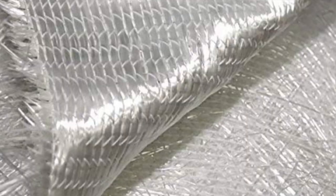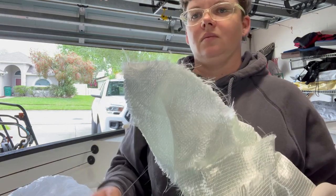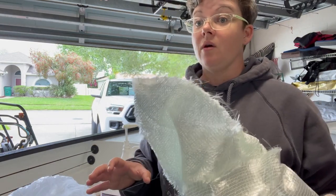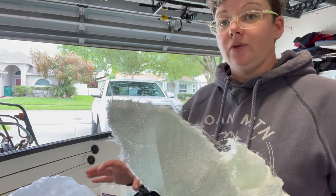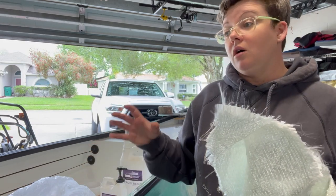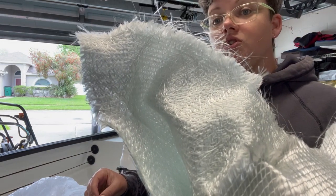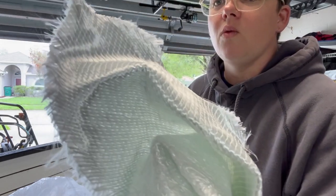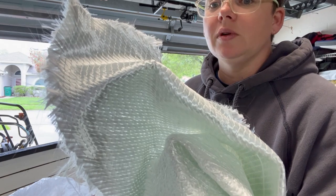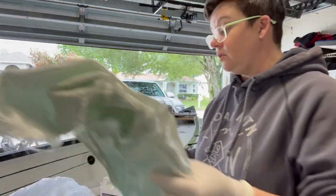It's called 1708, and it ended up giving both thickness and strength — and it's real nasty to touch. I'm going to show you some right here. 1708 is great for big projects where you need a lot of strength, where you're redoing older fiberglass that's still viable but getting thinner, or remaking large areas. This stuff has the chopped on one side and the woven on the other in multiple layers — a woven going one direction, another woven going the other direction, and a layer of chopped — three layers total that give you the ultimate strength.